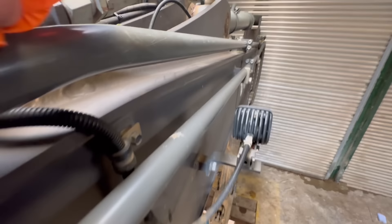Check all the seals — they're all right. Seeing we've got the air filter out — that one's due. Then the pre-air filter as well — they're never usually that bad, but we'll just get that and slide it back, put another one in. And there's the cab filter as well — I can't remember where it is on here, I'll have to find it in a minute. Just been there and done the greasing — there are a few more to do down on the quick hitch yet.